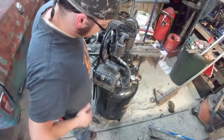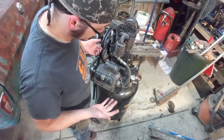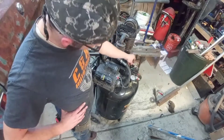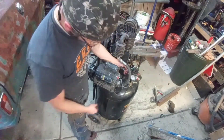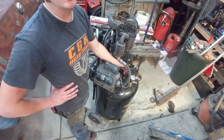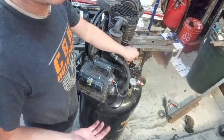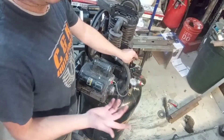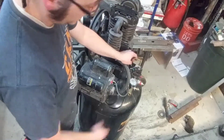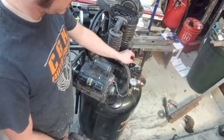A lot of how I put this thing together was just buying parts — I didn't really build a lot. This is the original copper line for the pressure relief valve; it just goes down to a union. And this is just a regular grease gun hose. Those grease gun hoses are rated up to 3,000 PSI. I'm not putting any weird chemicals through it — it's just air plus whatever water might happen to be in it — so there's nothing that would damage the hose itself. That's plenty strong enough to deal with the 145 PSI this compressor goes up to.